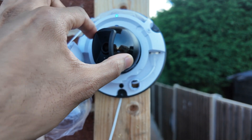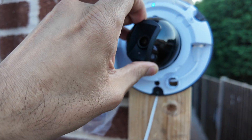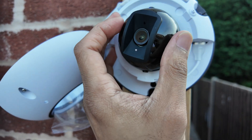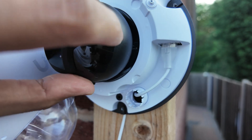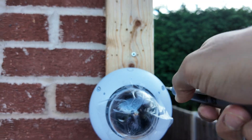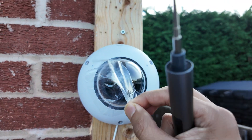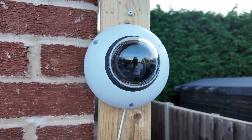I've loosened the top and bottom screws. You'll see around the edge there are two color differences — you hold onto that part and then turn it before screwing the top back in. Make sure you check the camera angle and have the right one you need, then screw the top plate on. There are three screws — tighten all three up, take off the cover, and then check it in UniFi Protect to confirm it's in the right position.